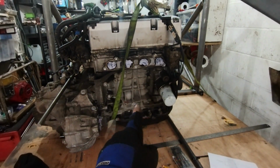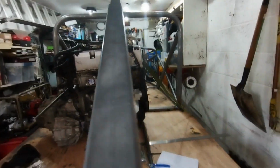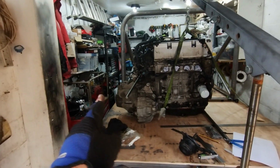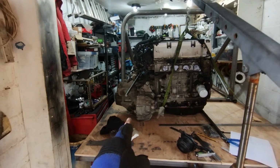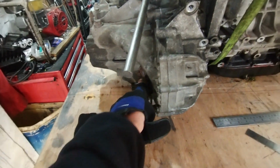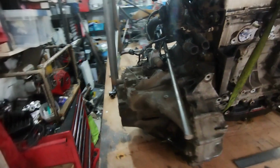Or I really think having the engine central and actually shift the engine slightly over, because obviously we've got bags of room this side and it's quite tight that side now with the gearbox on. The drive shafts are uneven length anyway, because they come out of the diff here and here. So on the normal car, I think they probably use these mounts here as like a straight drive shaft and then a CV joint kind of here, which obviously I'll be doing the same thing. Yeah, God, it's complicated all this, isn't it?